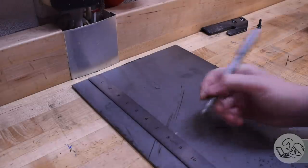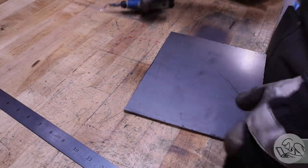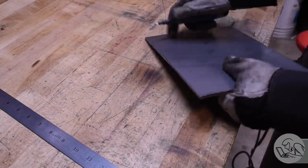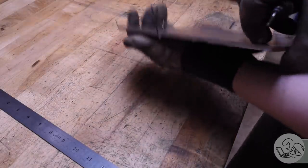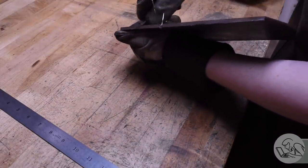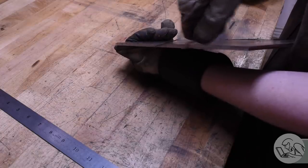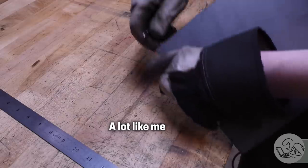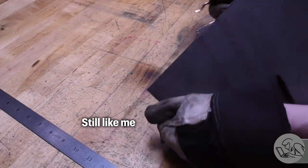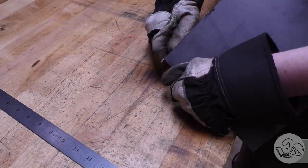I've found a good chunk here that I can cut and only have to make one cut, because this plate is very heavy and I don't want to make a lot of cuts. The only tool that I had that would really do this is the angle grinder with a cutoff wheel. Takes a long time, not a lot of fun. An angle grinder should be anyone's first purchase who's interested in metalworking because they can do basically every metalworking job — the problem is they do no metalworking jobs very well. So pretty quickly you want to upgrade to other ways of doing things.